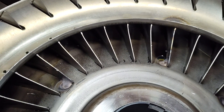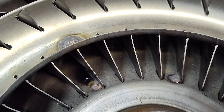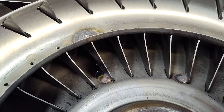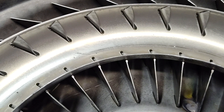You probably hear a lot about furnace brazing, welded fins, and that sort of thing. And this is the reason — you're either going to furnace braze or weld the fins to keep them in the pockets. And I'm in the process of just starting to do some welding on these fins.